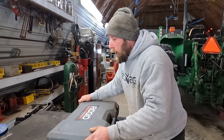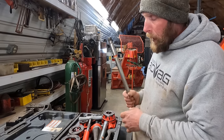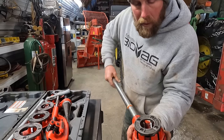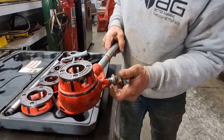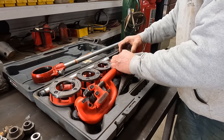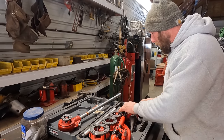This is a very expensive kit — I've owned it for 20 years. You can take pipe to town to have your plumber thread it, but on a Sunday morning, good luck. I can come down to the shop and have this done in less time than it takes to milk cows. This is my ratchet threader. Right now I have the inch die in there. You pull it out — there's an arrow that shows the direction — and if we're going to do three-quarter inch today, you swap the die in. I've got all the different sizes: half-inch, three-quarter, and inch are my main ones. And the pipe cutter — we used to use a hacksaw or chop saw, but if it's not square you have a hard time getting the threader started.